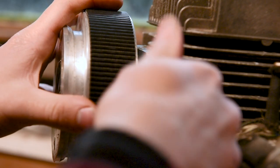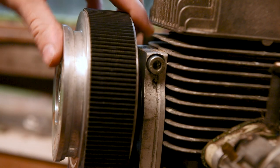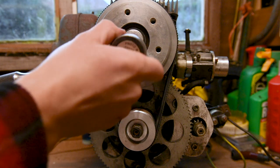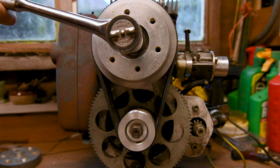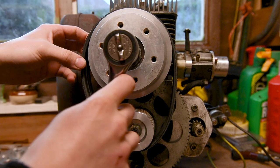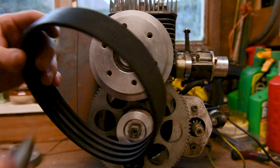Sometimes you'll need to take these right out, but you should be alright just leaving them in slightly, because it's only a pinch mechanism to keep this nice and stable. Now that we've got our pinch bolt undone, we can take our bigger allen wrench, pop it in the front here like so, and then as we loosen, you should see this belt loosen off as well. There we go — belt nice and loose, take it all the way down, and then your belt will come off like so.